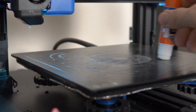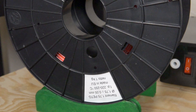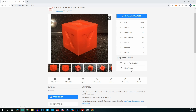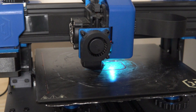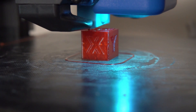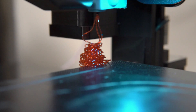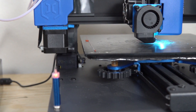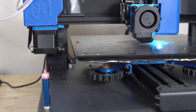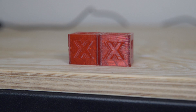I did want to try one other print though. I have a translucent red PETG that I know has moisture in it because I can actually see little bubbles when I print with it sometimes. I went ahead and printed out CHEP's little 20x20mm calibration cube. This should be an easy print just to quickly see if there is much difference between the wet and the dry version that has gone through the inline filament dryer. I set the temperature to 75°, which is what was recommended for PETG, and I purged 1000mm of material. This is to ensure that the material that is in there when it starts printing has actually been dried by the dryer, per the instructions' recommendations. Then I ran the exact same 20x20mm cube without any settings changed and put them side by side to see whether there was any difference at all.